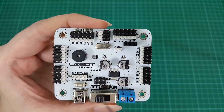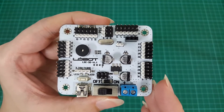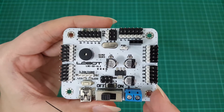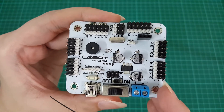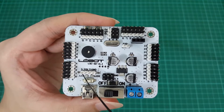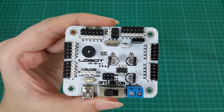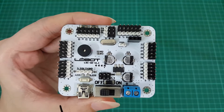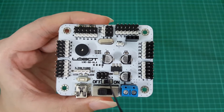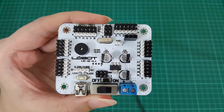Looking at other components on the board, there is a PS2 interface here with nine pins that you can connect to the receiver. There is an onboard buzzer which will alert you if there are any issues with your battery voltage — if your battery is running out of juice, it will beep and alert you. There is a serial port here with 3.3V RX, TX, and ground pins. Please take note that the layout may be different if you are using other modules and microcontrollers. And this is the test button that will execute action group 100 on this board. I will talk about action groups in a later video when we discuss programming.